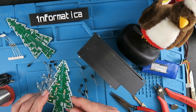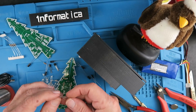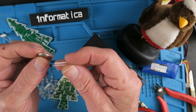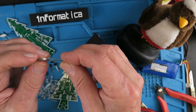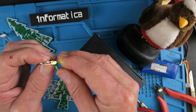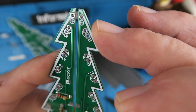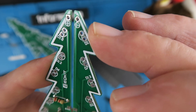With all the resistors fitted, it's now time to fit the LEDs. These are multi-coloured LEDs so perversely they're clear, and you can easily check these with a little button cell. The longest leg is positive and that's the side here. Clearly we can see the LED working there — the longest leg is positive. The positive and negative for the LEDs on the circuit board is indicated by the round pad being negative and the square pad being positive.